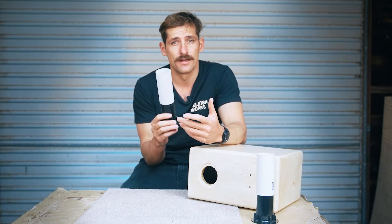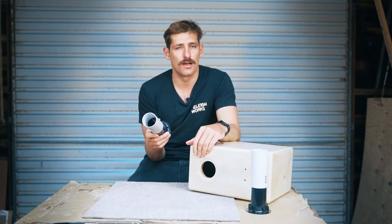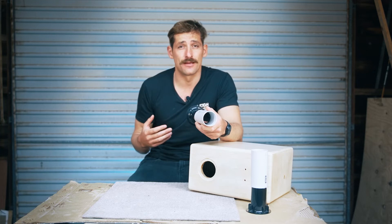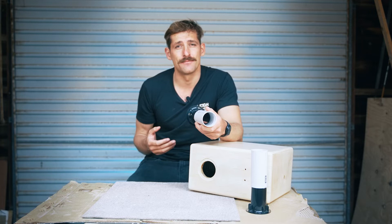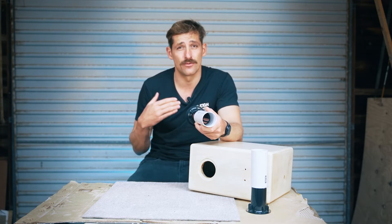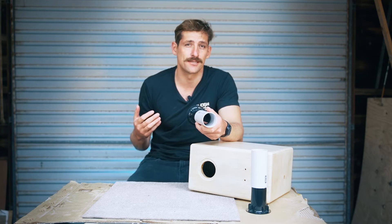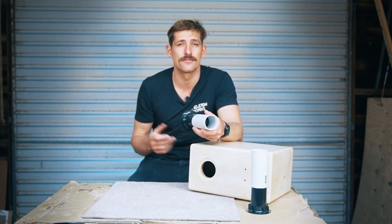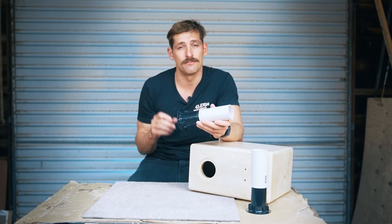You're probably wondering why we don't go bigger. Large volumes are great — they let you dig really deep — but the woofer has to work really hard at bass frequencies, which means you're at risk of blowing the woofer even at low volumes. I've found 12 litres to be a really nice compromise between bass extension and power handling.